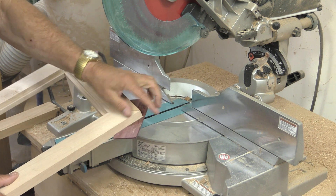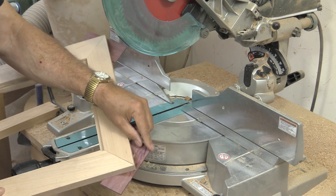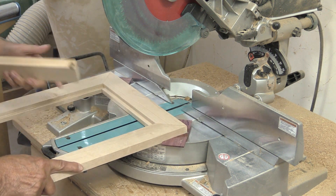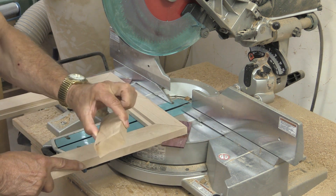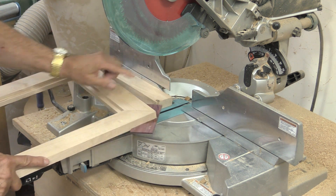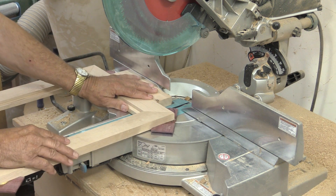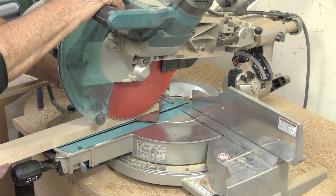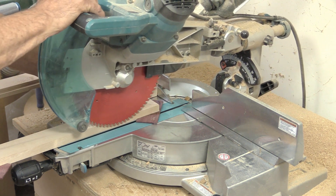The quickest way to cut these off is with a chop saw or a sliding miter. Of course we've got these pieces sticking out here so it's very difficult — you can't really line them up. So here's a little trick: get yourself a little piece of wood, make sure it's absolutely parallel, and it will become your new fence. Put it up against your existing fence, make sure it's narrow enough to fit in your frame like that, then slide it down, butt your blade on the inside as close as you can to the wood, and cut it off.